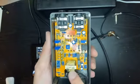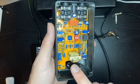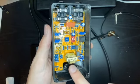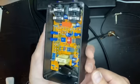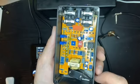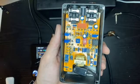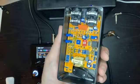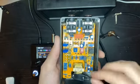Anyway, you can see this other big guy in here. This is an actual audio output transformer. So whenever you crank the gain on this, you're feeding volume into this output transformer. That's where you're getting that saturation and that chewy sparkliness that was not there whenever I took this out, because I did a lot of A/B testing back and forth to see if this actually made a difference, and it definitely does, in the same way that it would in a Marshall Plexi.